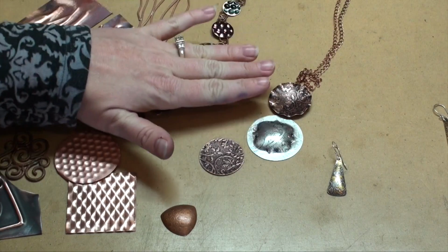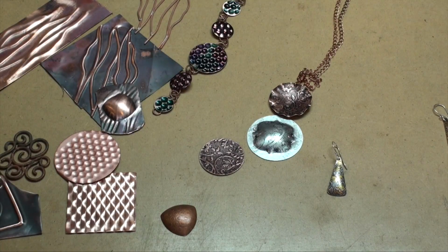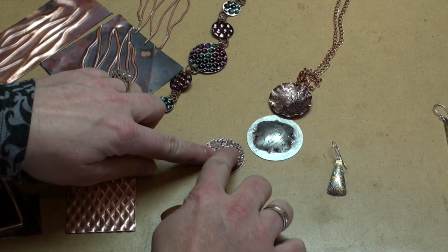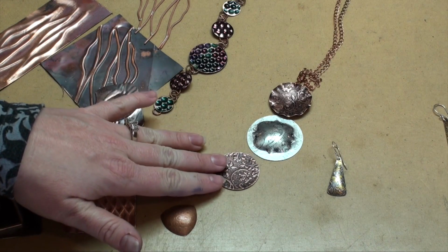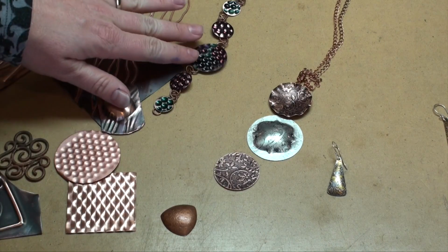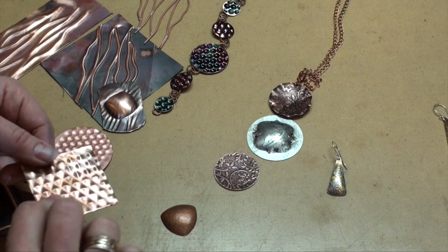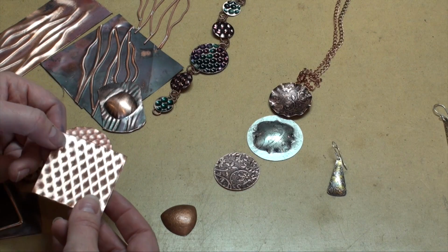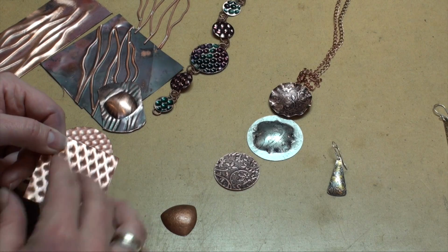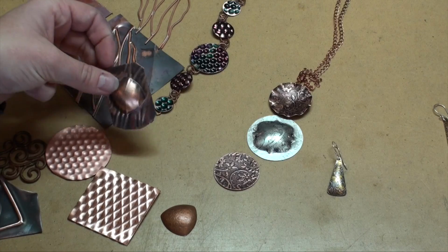So again, with the rolling mill, we have a low relief where we're actually compressing the metal around some of that higher relief in the texture dies or the texture patterns that we have. Whereas in the hydraulic press, we actually have a pretty high relief on both sides that can easily be smoothed out if we put enough pressure on this to form it into something else.